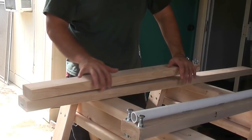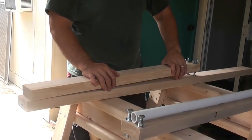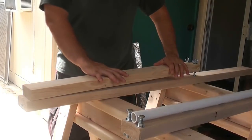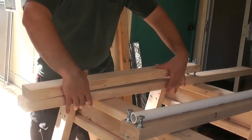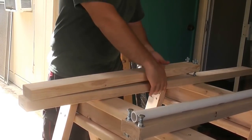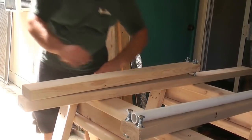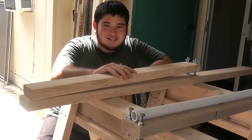If your PVC pipe is properly heated, it should only take about 50 to 60 pounds of pressure to get it to flatten. Otherwise you might want to use clamps — either screw type clamps or compression type clamps. That way you can just clamp this together and let it sit. So there it is. Thanks for watching and I'll see you guys next time.